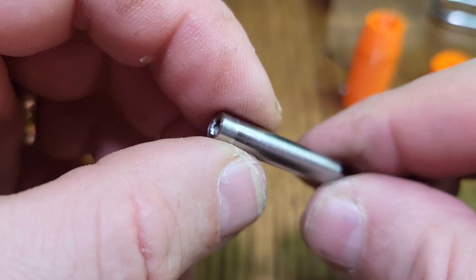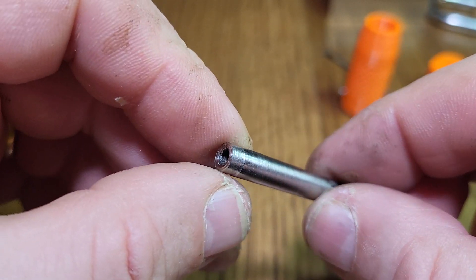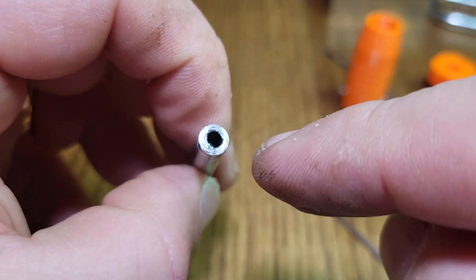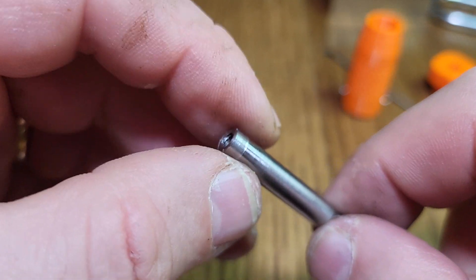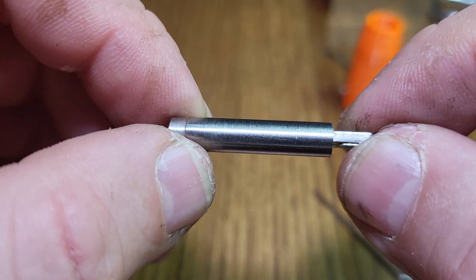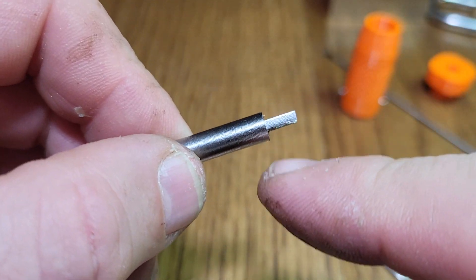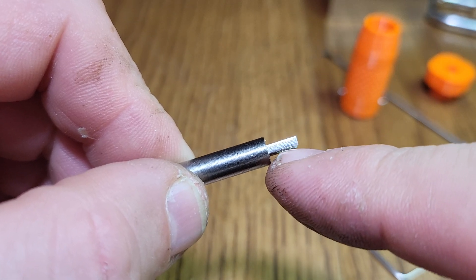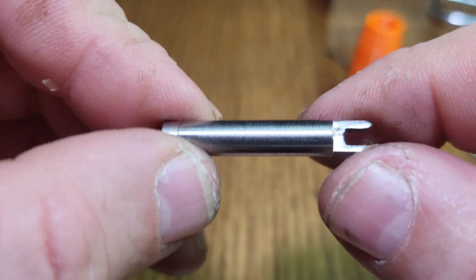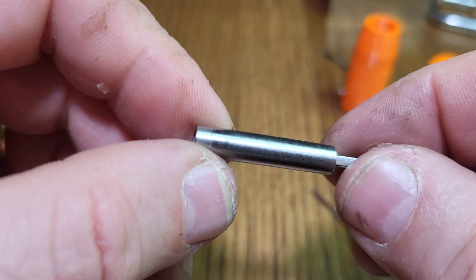What I would do in future is start with some stainless tube - minimum of 1 millimeter wall thickness, maybe 1.5 if you can get it. Then either stick a nylon dowel down the center of the hole, or fill it with some fiberglass resin and drill through the center with a 1.5 millimeter hole. You'd have a much simpler picking nose - all you've got to do is cut down and cut across with a fine hacksaw or file to get the picking tensioner. This took ages to make, but I think I could make the tube version in 30 minutes.